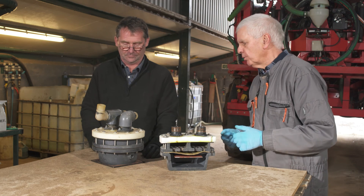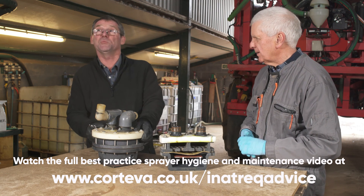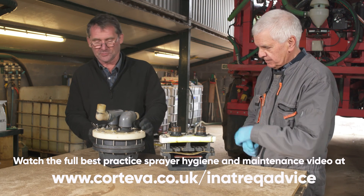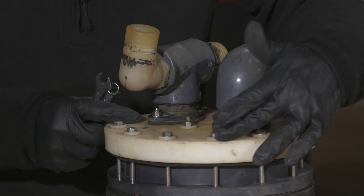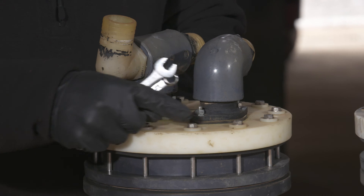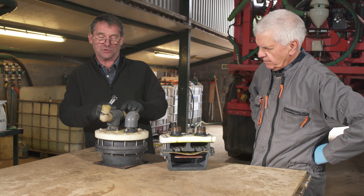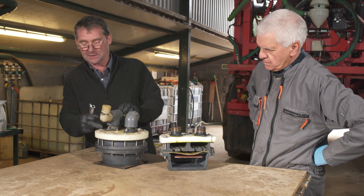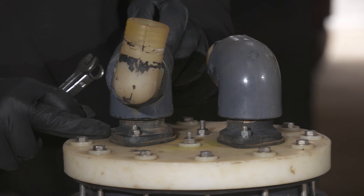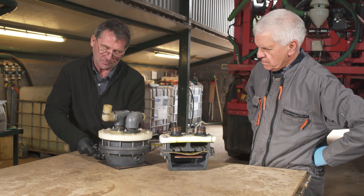Andrew will kindly show us how he services a Ramsey box. Having removed the Ramsey box from the sprayer — disconnecting your pipes and your mounting bolts — get it on the bench. As you can initially see, there's a ring of bolts all the way around the outside and they've all got to come apart. A good point: if you've got chambers and certain valves that want to be in a certain direction, put a mark on one and match it to the other piece so you can put it back in the right order at the end.